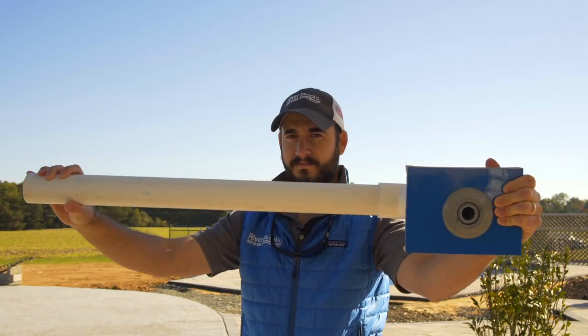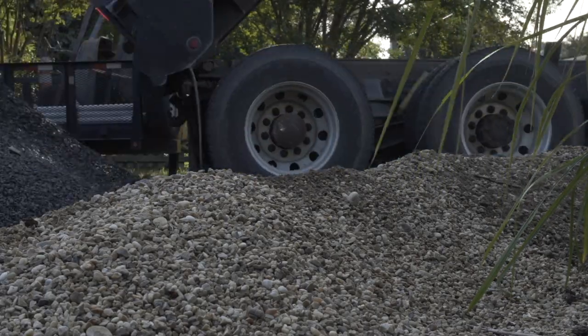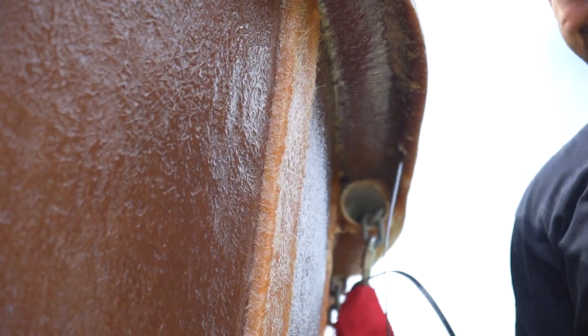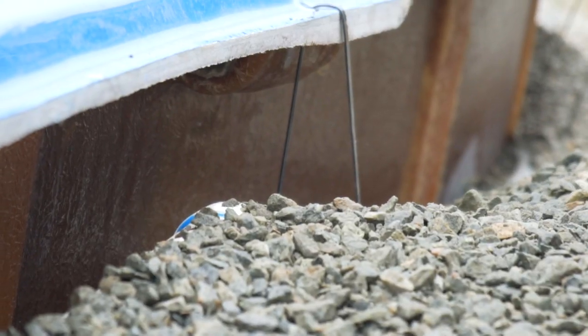You're going to have several of these placed throughout the inside of your pool. Ninety percent of the leaks we fixed occurred right here, and failure occurred when undue stress was placed on the plumbing. That stress was caused by the very backfill material we were taught to use: sand. When sand becomes saturated with groundwater, it settles, compacts, and shifts. When it becomes saturated it becomes really heavy, begins to push on the plumbing, causing it to sag and leading to a failure at the return fitting. The Rhino Rock solution is clean crushed stone for backfill instead of sand — stone doesn't settle or shift, so there's no worry about undue stress on the plumbing. We've fully encased the plumbing with stone because it provides support and prevents sagging. You also want plumbing installed with straps substantial enough to carry some weight, which assist in preventing the plumbing from shifting and settling over time.